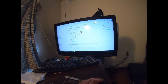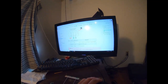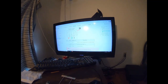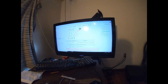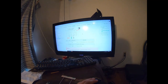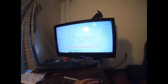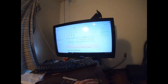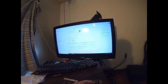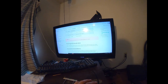So if we use the battery plug on the right side, it says 1 is power, and then 2 is reserved for S-Bus support. Huh. I wonder what that would be for. And then 3 is ground. That's all I care about, is ground and power. Boom, it's powered up. Looks like they're going to make that powered up for plugging into a Spektrum receiver or something, I think. And if it's powered up and it's going S-Bus, it can send telemetry more likely. I'm guessing.